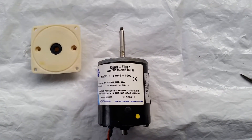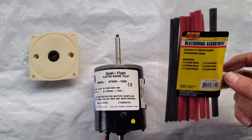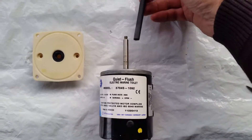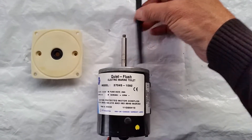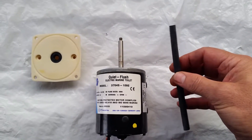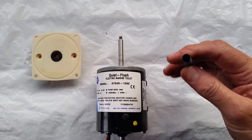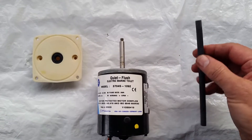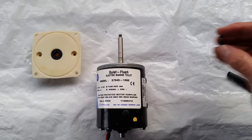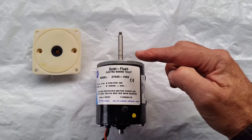What I'm going to do is make a repair sleeve using heat shrink, which you can get from pretty much any aftermarket auto store. The piece I've selected is just big enough to slip over the outside of the shaft, then you heat shrink it on with a heat gun. The sidewall is about ten thousandths of an inch thick, so doubled that's twenty thousandths of an inch bigger than the original shaft diameter — about half a mil. These rubber seals have a little spring on the inside that keeps the inner part of the seal in contact with the shaft.